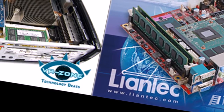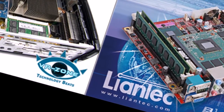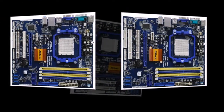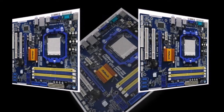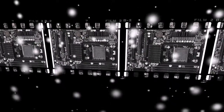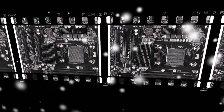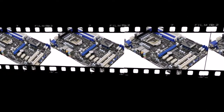On the opposite side of the board we see an M.2 socket, the top slot of which is intended for installation of a wireless WiFi/Bluetooth module, while the other three support PCIe x4 and allow installation of drives in 2260 and 2280 form factors. The storage subsystem on this platform can be very productive when installing three drives with support for NVMe and PCIe RAID. The front of the board has a standard set of connectors including audio and USB 3.1 Type-A and Type-C ports. ASRock claims support for Thunderbolt 3, but no ASMedia ASM-1142/ASM-2142 or Intel Alpine Ridge chip was visible on the board.